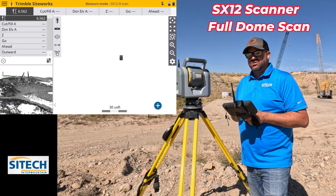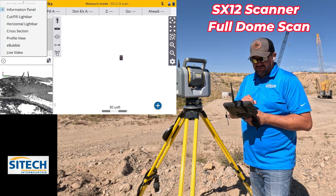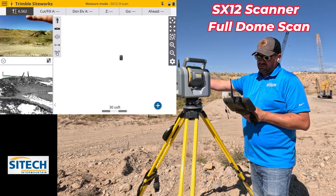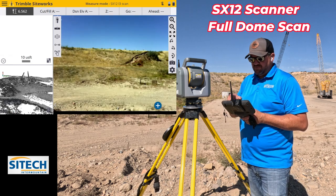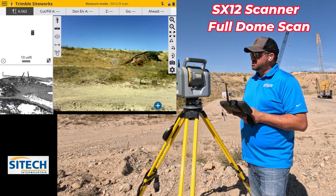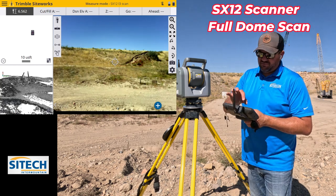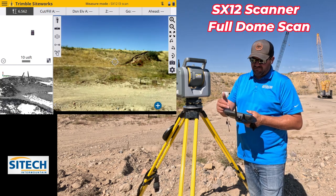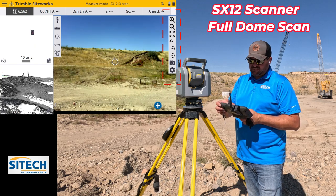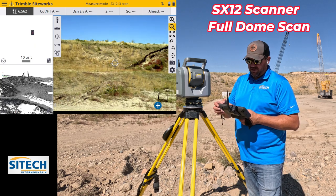The other thing to be really aware of is the different options on your screen right here that change also with the SX12. So on your left side where you've got these drop-down arrows, you can actually put this one on live video. That one's a live video of what's going on in front of the total station, and then you can move it over. So if you're not actually out there with a range pole and you're trying to pinpoint specific things, based on the different views that you bring over here, you get different options on the right side. So you still have your normal plus and minus to zoom in and out that way, or view in and out that way.